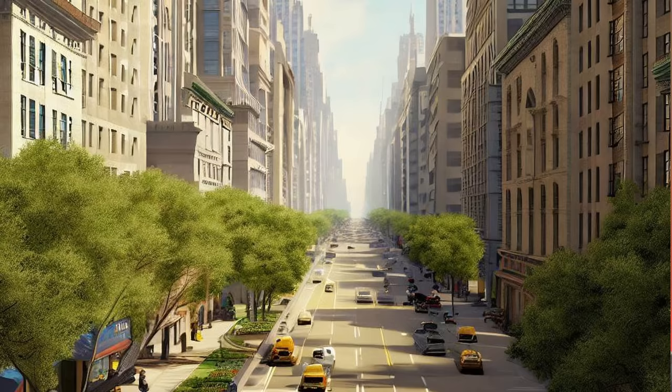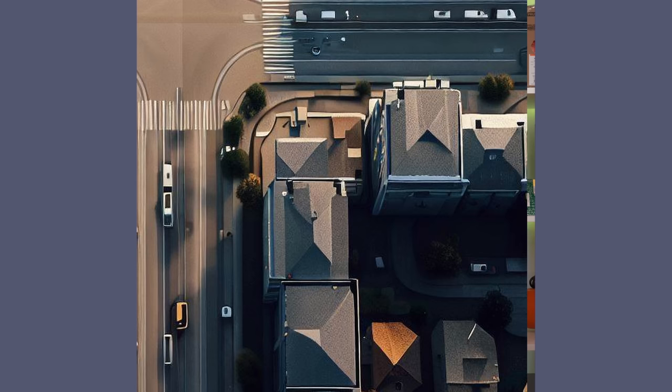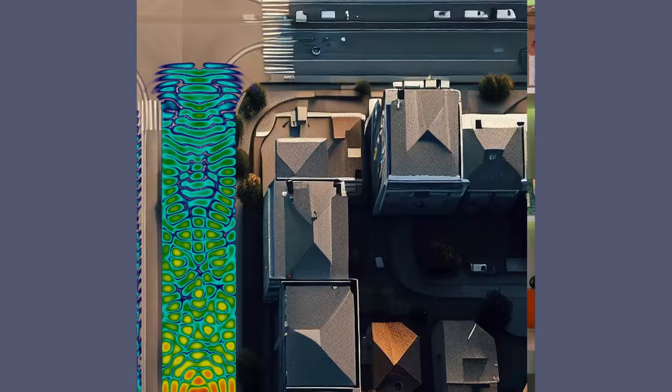But wait — where did that energy come from? It was supplied by the incoming electromagnetic field. So, surely they cancel out? What actually happens is that the two fields are superimposed, but they don't cancel. There might be cancellation at some specific points, but imagine you send a radio beam up a narrow street of tall houses. You suspend your aerial rod vertically in the centre of a crossroads junction. The rod gets immersed in the electromagnetic field of the radio beam. Those houses are made of material that soaks up radio energy — which is why I can never get a cell phone signal inside my house, which is made from damp bricks. The rod absorbs energy from the electromagnetic field and generates its own field as a result. The rest of the radio wave energy disappears straight on from the junction.